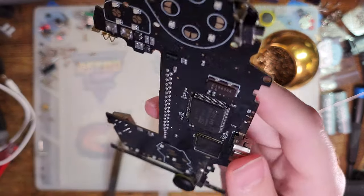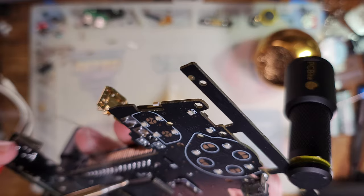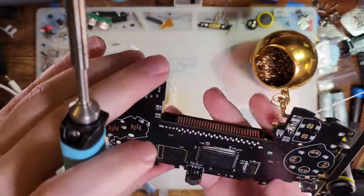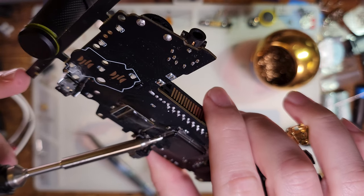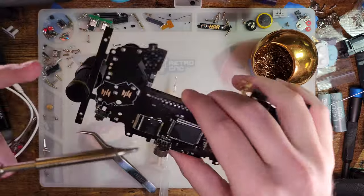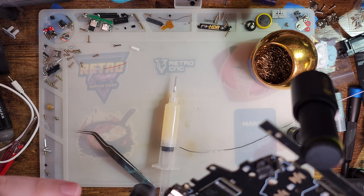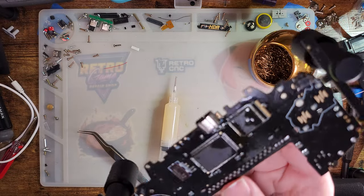All right. And that side is nice and soldered. I don't even see any shorts. This bottom side, I think I'm going to have to do under the microscope, because quite a few of those pins were bent. But otherwise, there's no shorts. Got the shorts cleaned up here as well. Easy. And last but not least, top. Easy peasy.